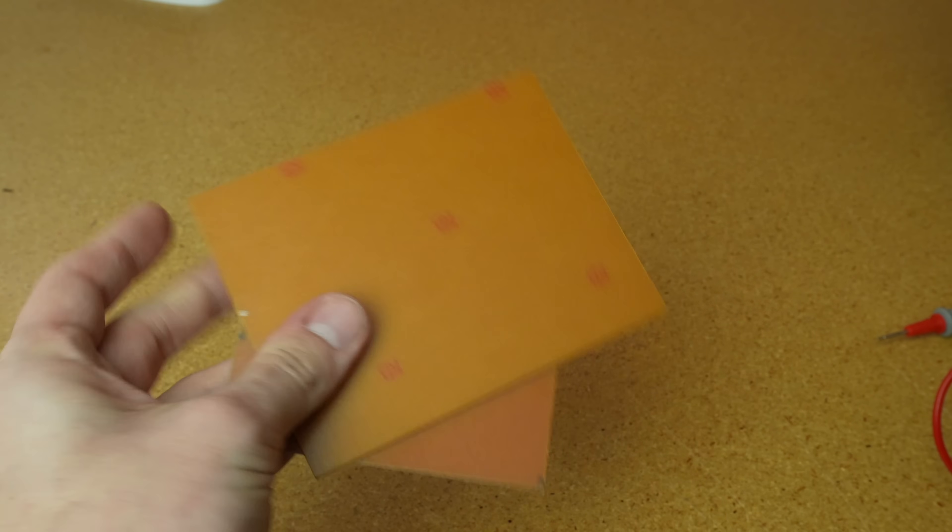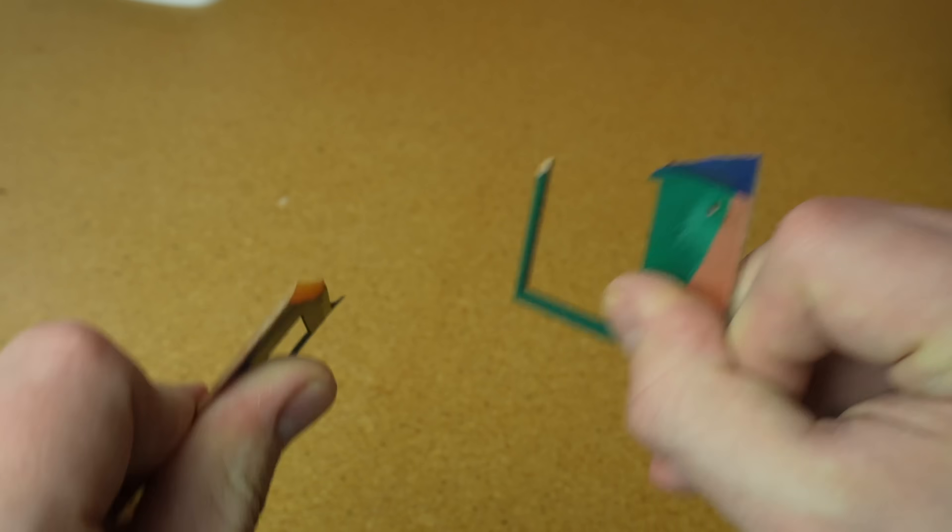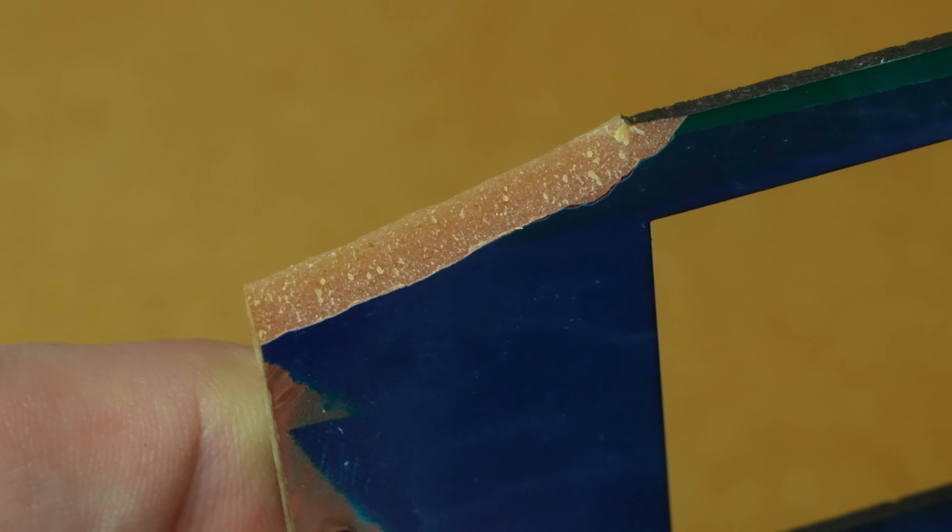FR1 is not really used anymore — it's more like a cardboard with a phenolic resin embedded in it, and it's way less abrasive. So if you're milling a PCB it's ideal; it's not going to ruin your end mills. The reason I'm going with FR1 is that it is so much easier to ablate away the copper and not destroy the substrate underneath.